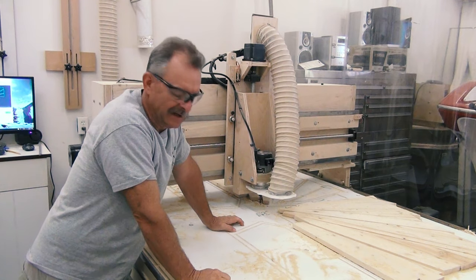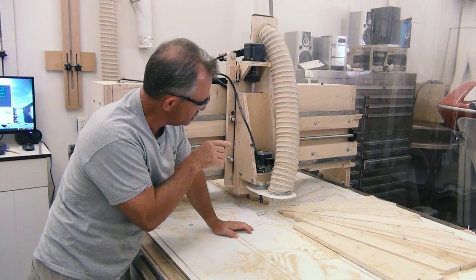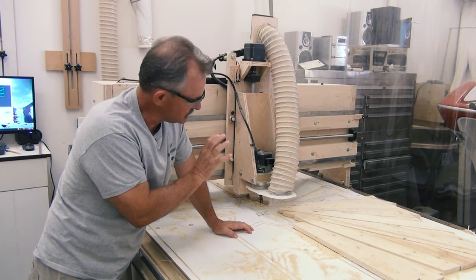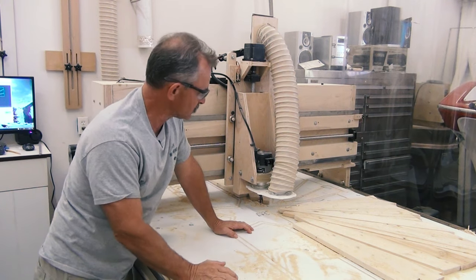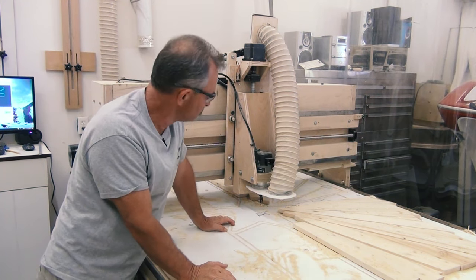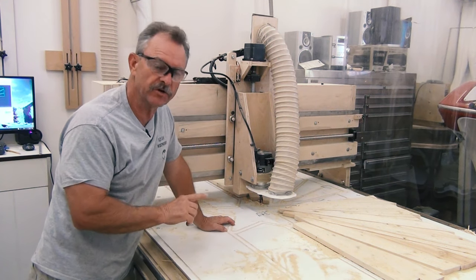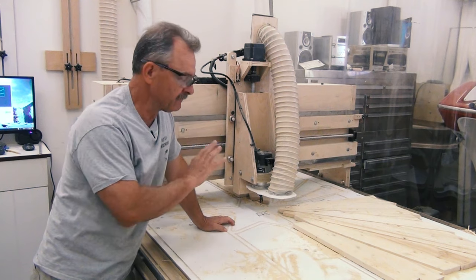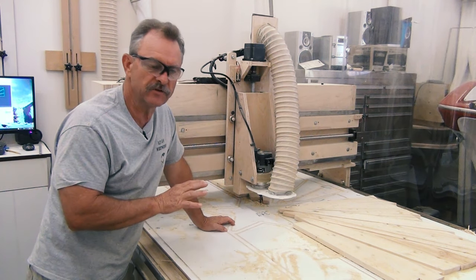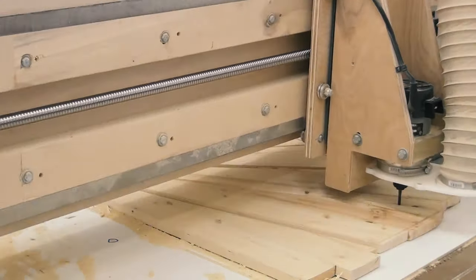You know what I really like is when I have to do something over again. I hit something — my A axis slipped and this thing went out of square. I was only able to cut four parts that were correct and had to rebuild a whole bunch of stuff. So we're going to start it again. This time we've got four parts already done, so now we only have to do about nine more. Loaded it up and started over again.